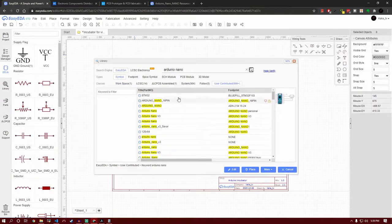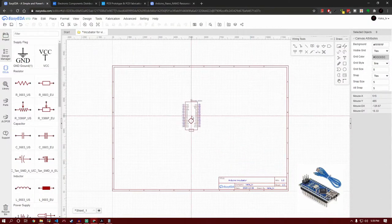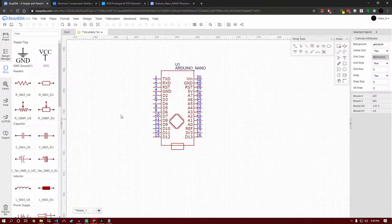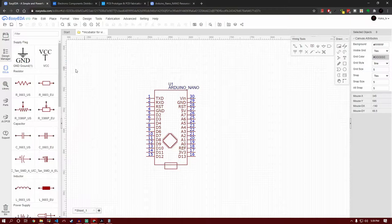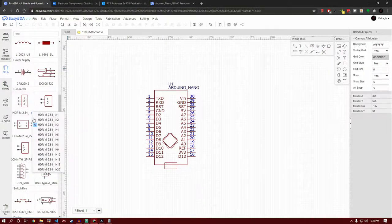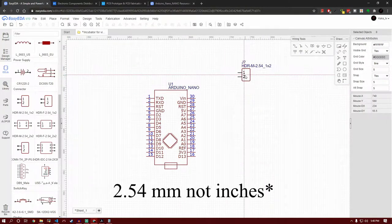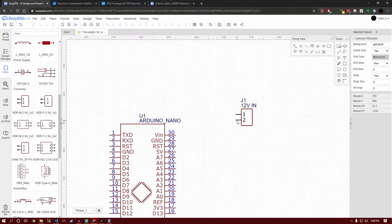I'm going to add an Arduino Nano in the sketch by searching in the EasyEDA library. It doesn't need a proper PCB footprint since we're only using it inside the schematic. I will not be making this PCB-compatible because that would take more time — maybe we can do it in the next part. I'm going to choose a 2-pin 2.54mm connector, which is a standard Arduino connector, and place it inside the sketch. You're going to notice a difference in wiring in this video because I'm using net labels or net ports.